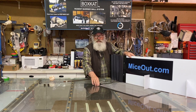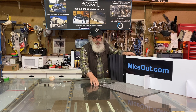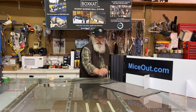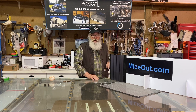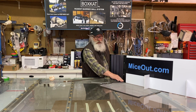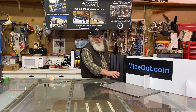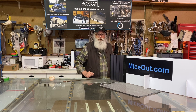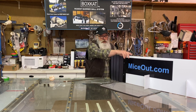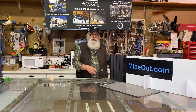You don't have to tape it — I just did that to handle it around the video table here. I'd put a couple of spikes in it in places where I needed to to hold it down, maybe backfill it with the gravel a little bit, not too much — you don't want to build a platform. But mice can burrow under this if it's on dirt or gravel, so put some wire down all the way around the perimeter of where you're going to put the Boxcat.